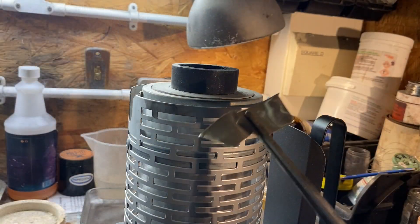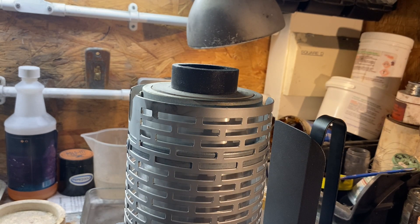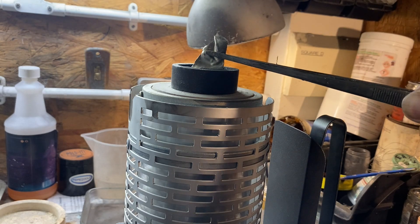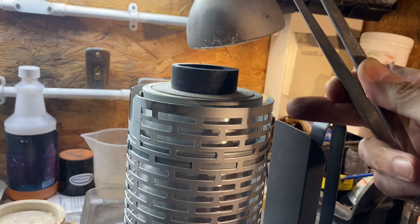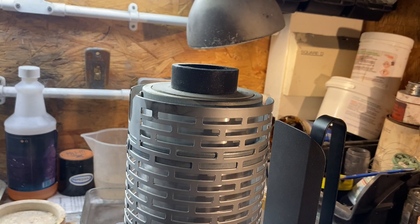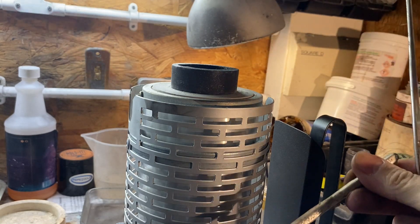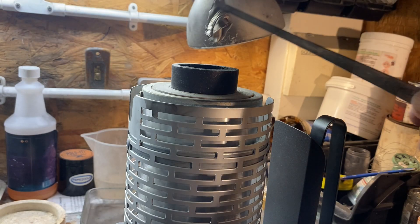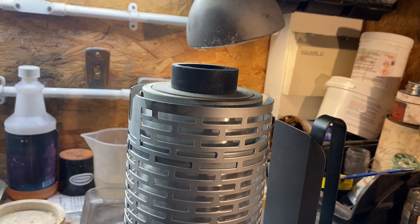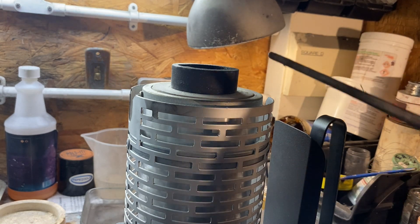The crucible's cold at the moment, but even so it's a good idea to use tongs. Very important: place the silver in gently. If you've got really heavy pieces from casting, don't just drop them in — something like this that's a couple of ounces of silver, if I just drop that straight in I could crack the crucible. So place it in gently. You don't want to fill it completely — fill about a third of your weight and then let it melt down, and when it's melted add some more.